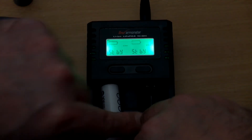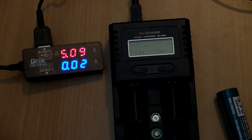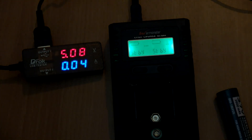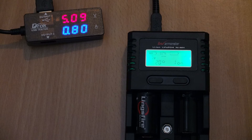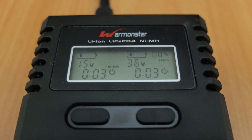If you insert a battery the wrong way around, no warning comes up but it doesn't attempt to charge the battery, so it's safe in that regard. It also has a voltage activation feature. Testing the standby, to verify there isn't any additional charge going into the cell — when I take the battery out it doesn't change much apart from a slight drain for the LCD display, so the termination does properly terminate with lithium-ions. There's a slight trickle charge with nickel-metal hydride. The highest charging speeds I got per bay were just under 0.9 amps. One weaker area is that you cannot manually reduce the charging rate for small lithium cells — the workaround is to use the mini USB plugged into a USB 2 port.